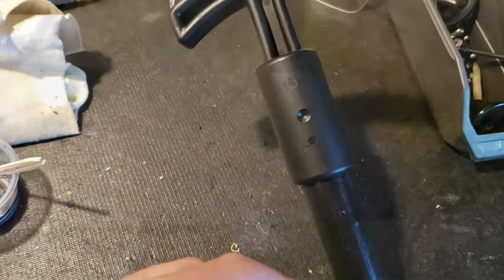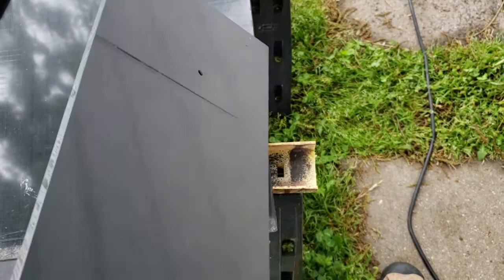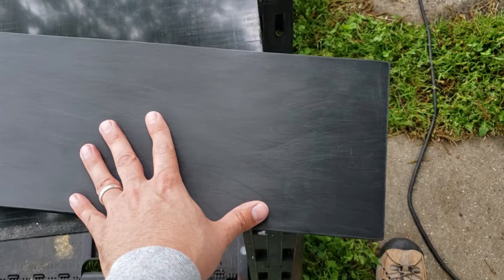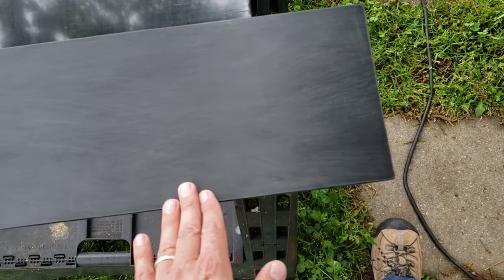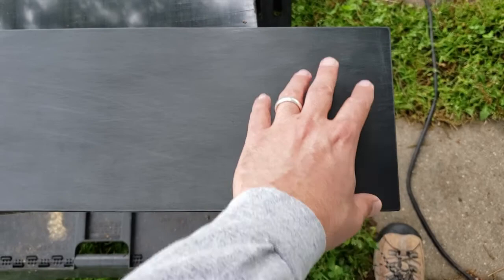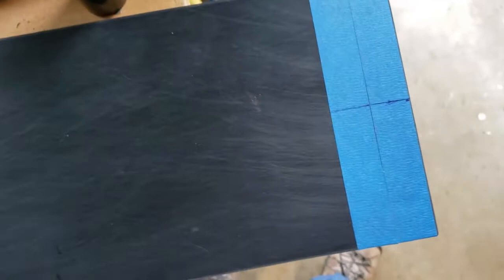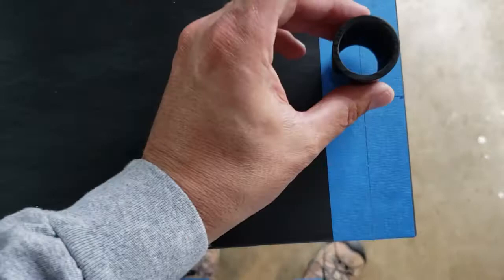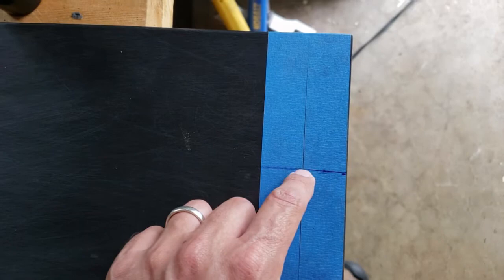I've made my first cut here on my HDPE, and you can tell I roughed up the surface a little bit too — I just didn't like all the glare and sheen that this particular piece of HDPE has on it. So I put a rougher finish on there to help cut down on glare. Now I'm going to try to contour the sides a little bit to get it more in line with the stern lines of the boat, which will also help reduce the weight and any extra instability caused by excess material. I've used masking tape on the HDPE so I could mark it cleanly, found the center line, and now I'm going to drill my hole that my PVC will fit down into — using a spade bit.